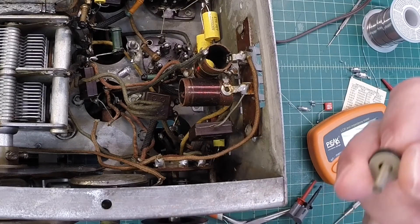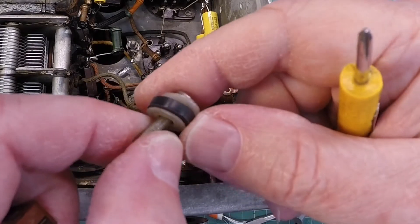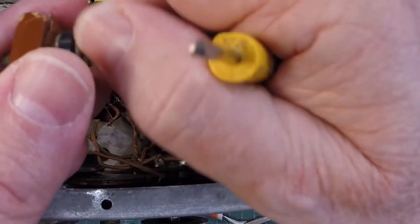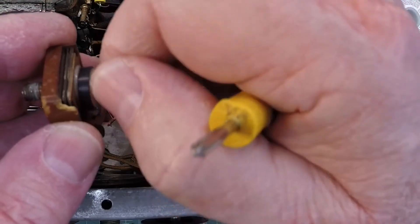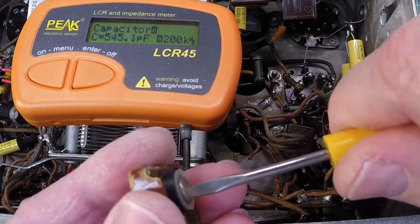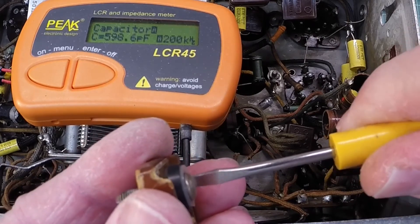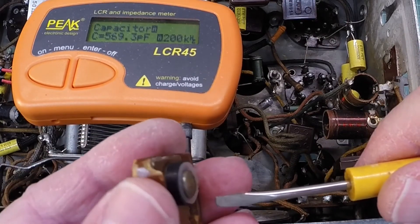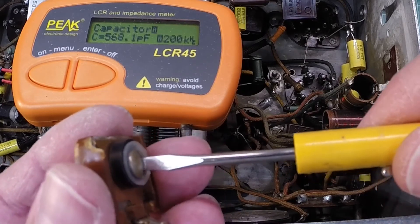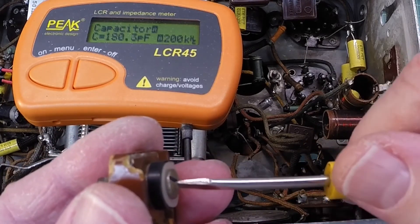I've got two fiberglass washers here on each side of a rubber washer that was most likely around the same thickness. So I think this will serve me well. I'll put this back in and get the LCR meter up and check. If I tighten this all the way down, I should be able to get somewhere near 600 picofarads. I may throw one more fiberglass washer on here — on each side I see just a little bit of bowing as I tighten this down. Then let me get it reinstalled back in the radio and see if we can stabilize the performance.